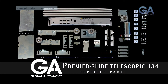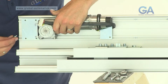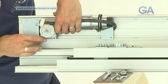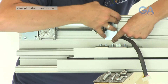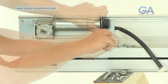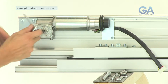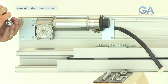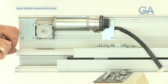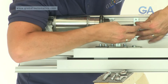Stage nine, fitting the motor gearbox. Select the motor gearbox, one cable strap and eight Allen bolts. One, insert six Allen bolts by hand as shown. Two, tighten as appropriate. Three, fit the cable strap with two Allen bolts, ensuring the cable is not trapped and position centrally behind the cable strap.